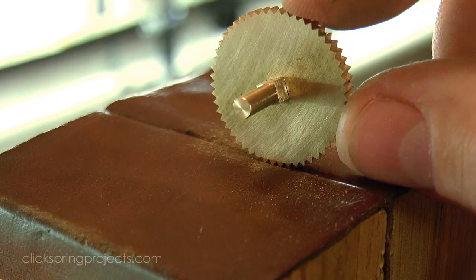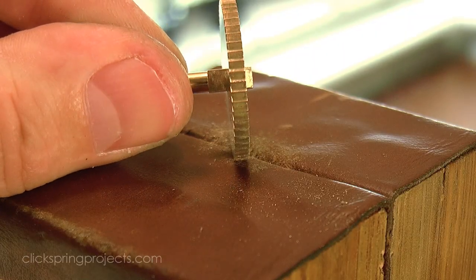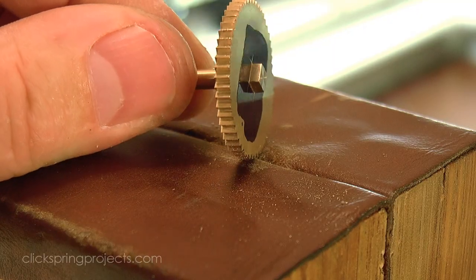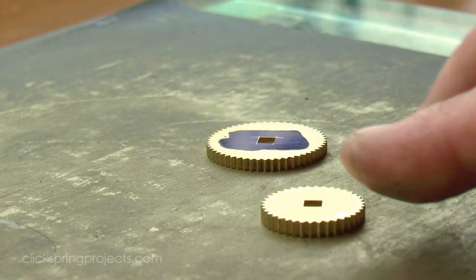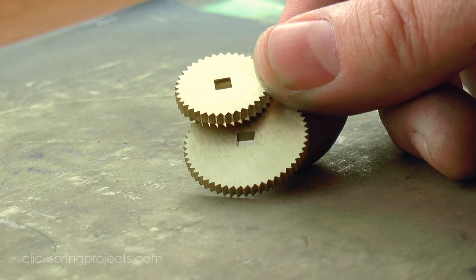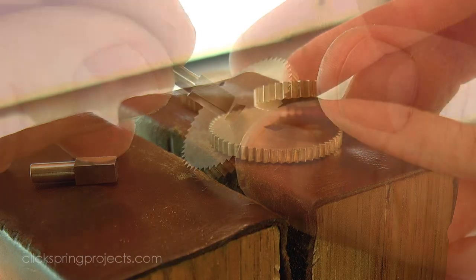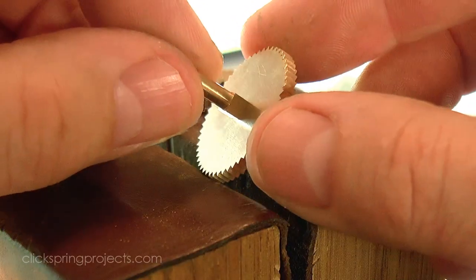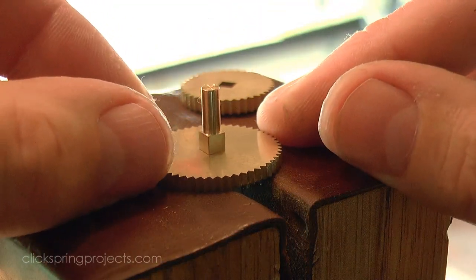Now, in each case, it didn't necessarily need to be this way. The main bearing could have been made to lift B1 a little higher, and so provide enough room for a fastening pin. And the L pivot could have been made with a larger diameter, without that much of a friction penalty. But they weren't. Instead, the much more challenging route was taken of fastening the wheels using a firm interference fit on a very small tapered square arbor.